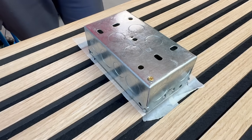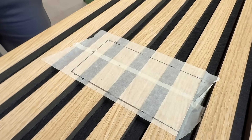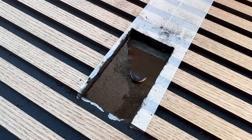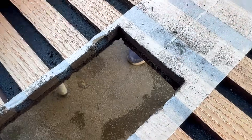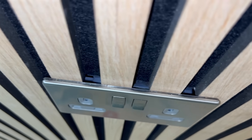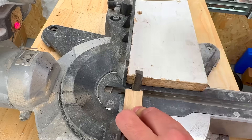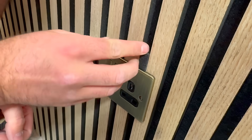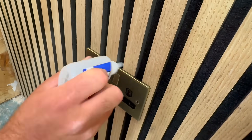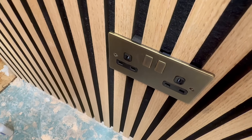To get a neater finish, the next logical step is to cut the panel to match the size of the back box rather than the full faceplate. That definitely helps improve the visual result — the socket now sits forward and the cutout isn't as obvious — but we've still got the same problem: open gaps between the slats and potentially exposed terminals behind the accessory. Here's our solution: take the offcuts from the hole you've just made and use them to create filler pieces. These can be glued in place between the slats using a bit of contact adhesive. It's simple, effective, and keeps everything looking uniform while helping close off that risk of accidental contact with live parts.